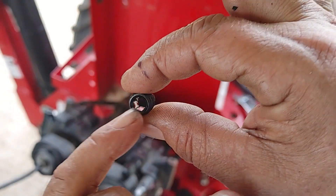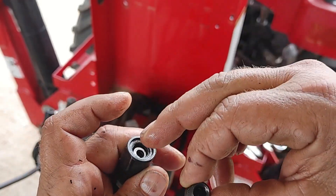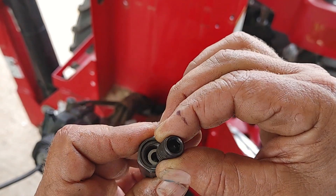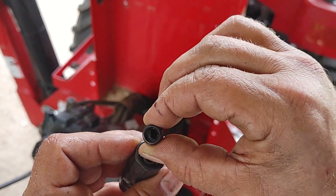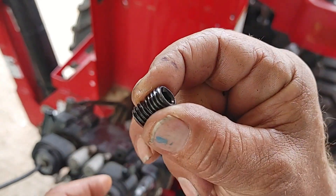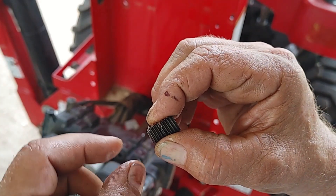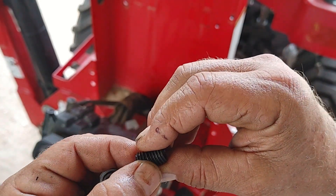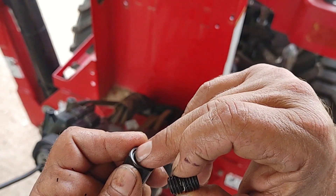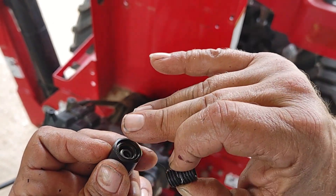From the looks of it, this takes an Allen. This is all one piece and it screws in — probably setting the tension on the spring. Then you screw the cap onto whatever is sticking out, tight against the oil seal, which is embedded around the edge, so it don't leak around these threads. That's what it looks like it does. And she broke. So if I can just get this piece out, I might be able to bring it to a hydraulic shop and they might actually have one with the same thread. This is where your seal sits — right in that little groove — and then the cap presses down on the seal.